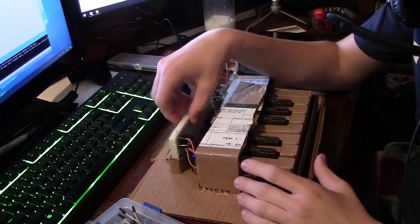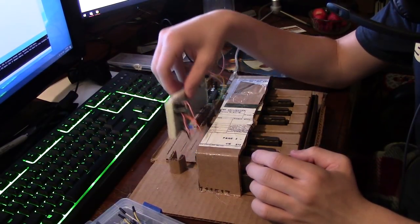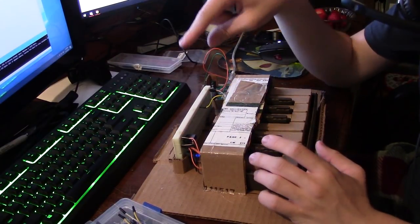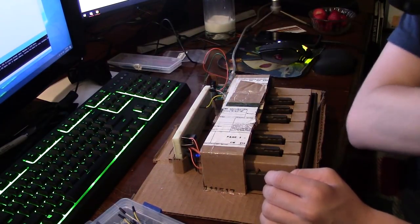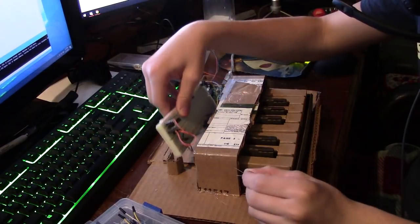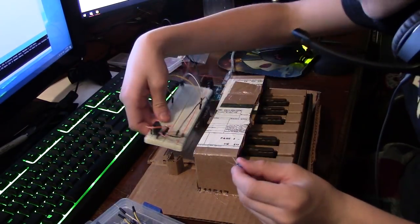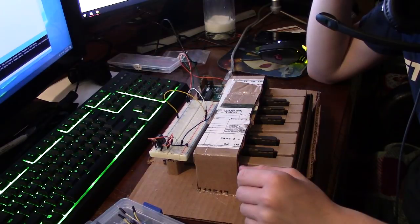I've come to discover that if I remove the LED from the circuit, the output I'm going to be getting from the IR sensor to the PC is always going to be 1023, which is the max value. But once I add the LED to the circuit, then it starts working fine, completely fine. As soon as I unplug this LED and put it in, it's always pressing key one — you cannot see it, but it is always pressing key one. I do not know what to do, so I'm just going to put a debug LED for all of them, and that should be fine.